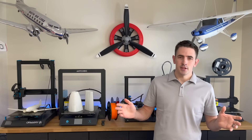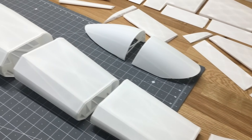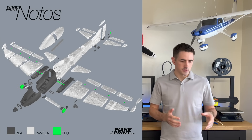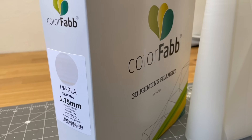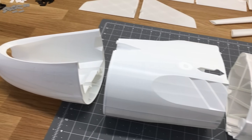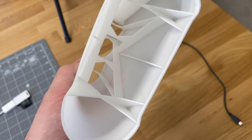Welcome back to the workbench. Today I'm going to be showing you how to build and assemble the entire Planeprint Notos. For the printing process, it's pretty basic — not a lot to cover. It does use a hybrid system between PLA and lightweight PLA. Planeprint has a nice diagram showing an easy comparison between the PLA, lightweight PLA, and TPU parts within the build. It's important to use lightweight PLA to get the CG set right and get the performance we're looking for in this aerobatic airplane.